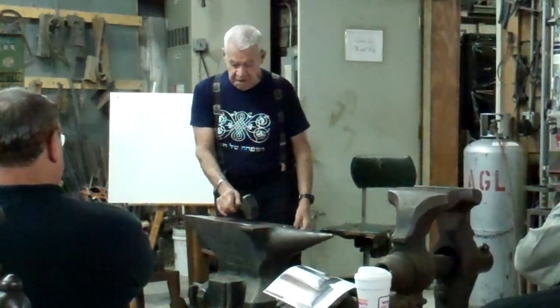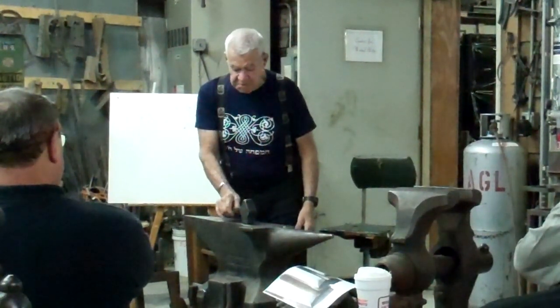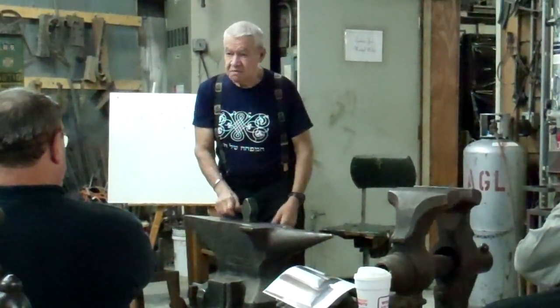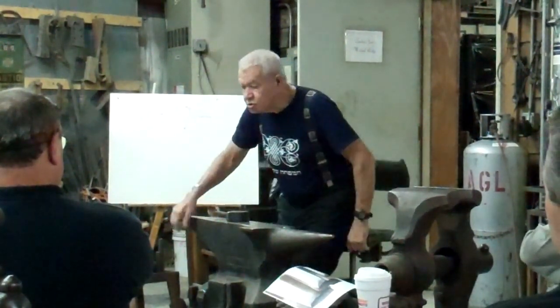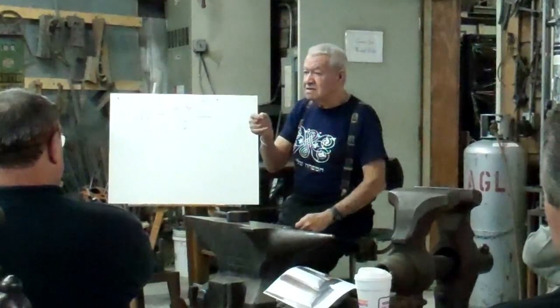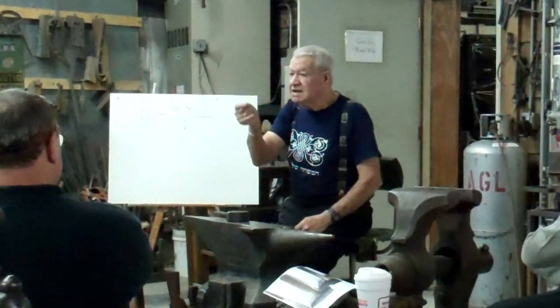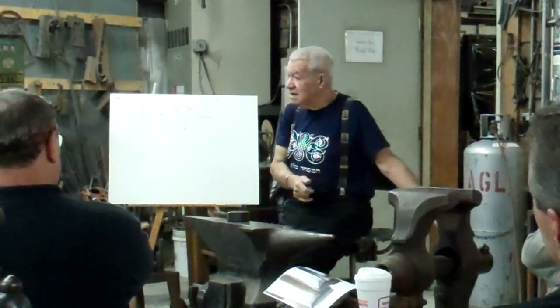So now we move the hammer like this, and by tilting the hammer and leaning with the iron in the right places on the anvil, we move more metal and faster to use the heat. It's only how to preserve the heat and how to create heat while forging. Because heat is a lot of money, it's energy and time. It takes time until we heat the metal.